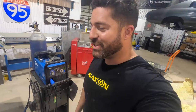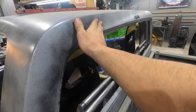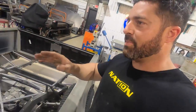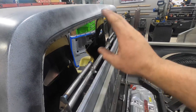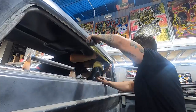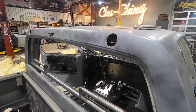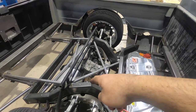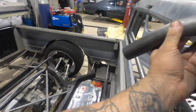So the time has come to do the deed. I know this is either going to make a lot of you guys stoked or it's going to piss a lot of you guys off. I'm actually going to drill a hole in this precious, beautiful cab — evenly space them — and that's where our back bars are going to come down. I just think it's a better look to go through the cab than through the rear glass or a Plexi. That way you can actually use rear glass if you wanted to. So now I'm going to measure it and have an entry point for our tubes. Now I'm going to measure for the angles that go to the cage — it's got to be kind of an aggressive swoop, and I want it to come straight down to one of those plot points. This is the way it's going to come out — I'm going to dive that straight into that miter and do a little swoop in the bottom.